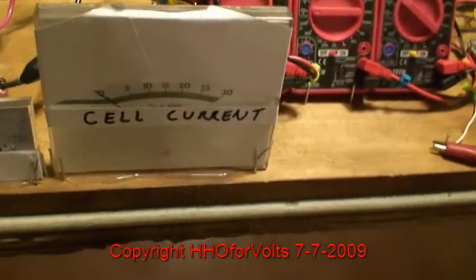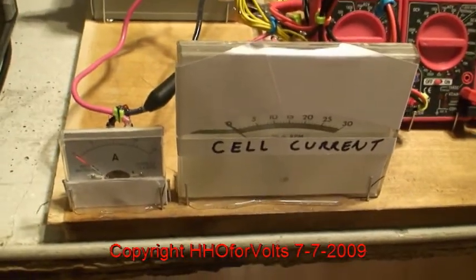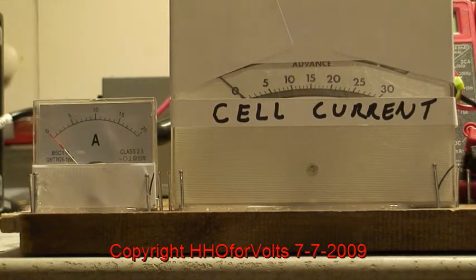Here's a calibration so that these meters were equal — just a little piece of wire between the two coils for fine adjustment, so it was a perfect calibration between the two meters. They don't look the same, but they read the same. After this, we're going to run it with digital meters because they're so much easier to read. The one on the left measures the current drawn from the power supply using the 12 volt yellow lead. The big meter is in series with the MOSFET to the cell. The rod is a transformer, but it's one-to-one, so we cannot attribute the doubling of current to the transformer ratio.